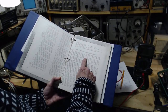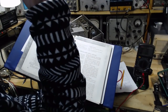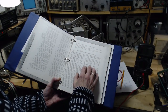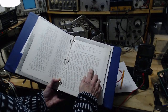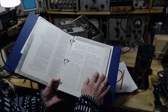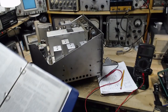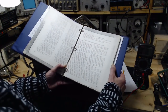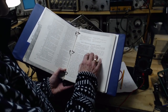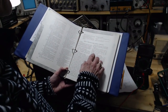When the equipment has been exposed to cold and is brought into a warm room, it will sweat until it reaches room temperature. Well, it'll condense water onto it. It doesn't sweat. Operation in tropical climates. When operating in a tropical climate, radio equipment may be installed in tents, huts, or when necessary, in underground dugouts. Like, can you picture this? In an underground, like a hole in the ground, and two guys in there with headphones on, trying to listen to the Vietnamese. Literally, that's what happened with this radio.